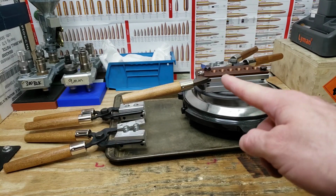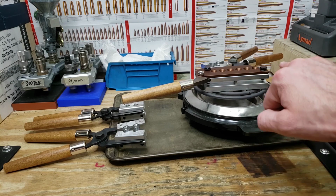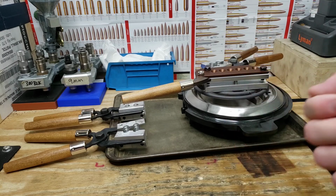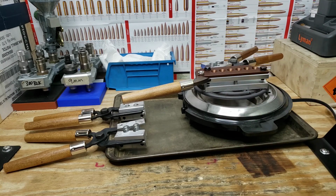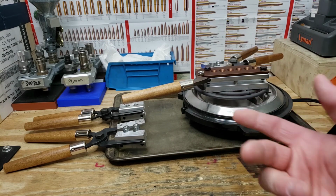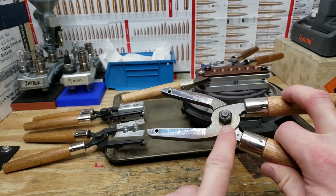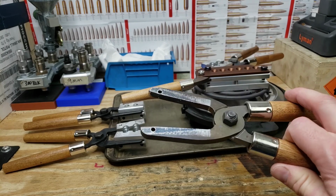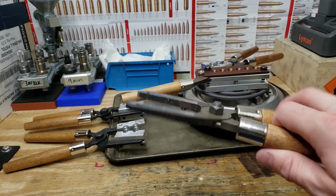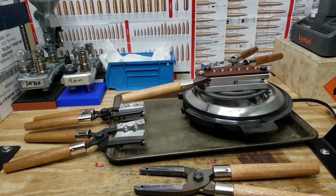And with the 6 cavity, since it's a little hot right now, I'm not going to actually pick it up, but you need a little lubricant here around these screws here and here. That'll help with your sprue plate moving in and out, as well as on the handle there. And when you have your 6 cavity handle, same thing here. You want to get the moving parts here a little bit lubricated, this screw and between the handles. Nothing too big. A Q-tip works really well for these small parts.